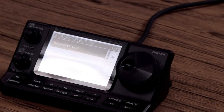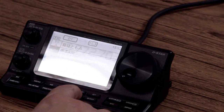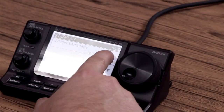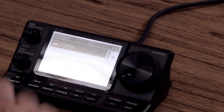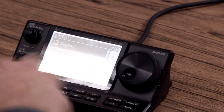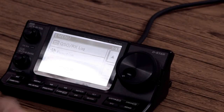What is near repeater? Near repeater will take your GPS coordinates and tell you what D-STAR repeaters are in your local area. We'll go ahead and exit out of the DR mode. Then your main set menu — that's basically just all the default functionality for the radio. Pretty much set that for the most part and leave it. But it's grouped instead of like some of the radios out there that just has a huge laundry list of functions — this is grouped together based on what it adjusts.